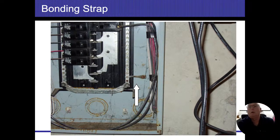All right. So one of the questions Mark asked: if the water pipes aren't used for grounding, is it still important to jump past the water meter? And the answer is going to be yes, because especially in our area, if I have a water meter there, it's very common. So the utility companies are going to be expecting to use that as well. The utility companies, such as the phone company, cable company, and satellite dish, all have to ground their items as well. So they may be grounding to the plumbing pipes. They may go ahead and ground to the meter box outside. Whatever it is, the expectation is there that those items are grounded.